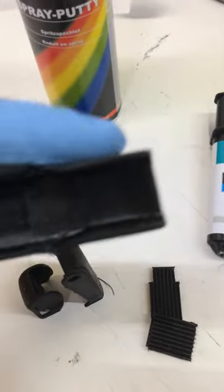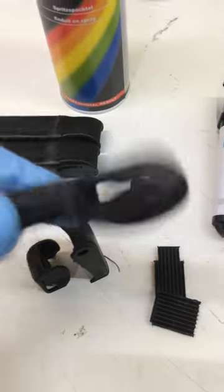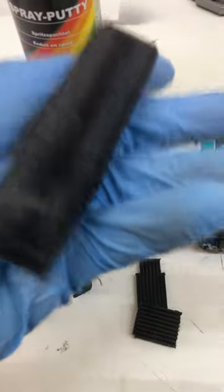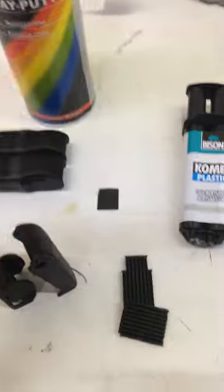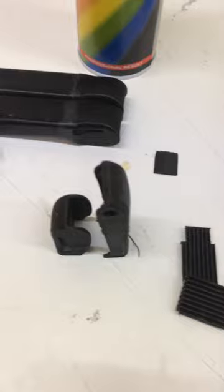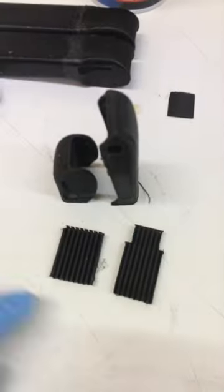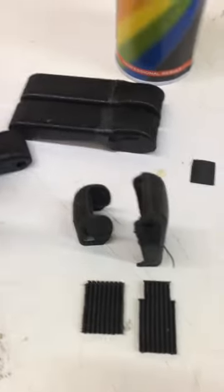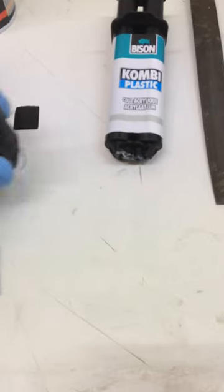Of course, here is a flat surface, but you got this little curve here and you will need support there — not too good. If you want to keep the outside clean and nice without the markings of the support, you have to slice it. Then you can put it like this on the bed, and the only two pieces of support you need are on the inside, so there will be no markings of support visible at all.